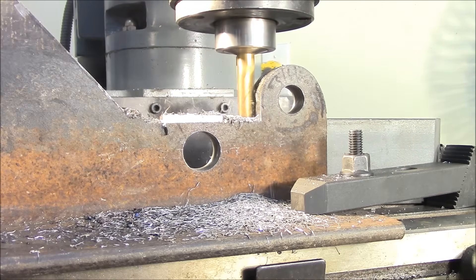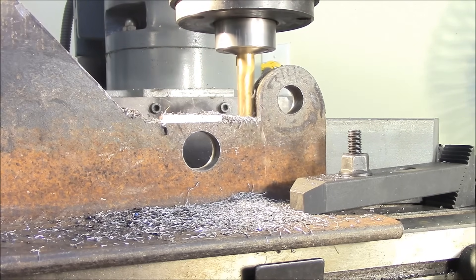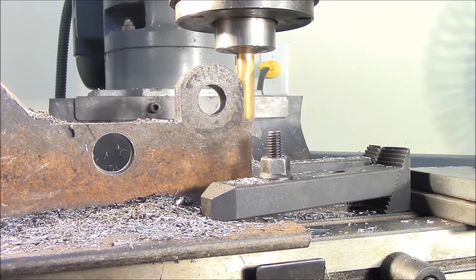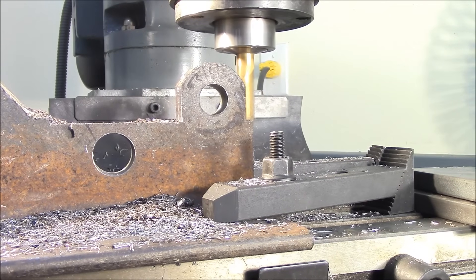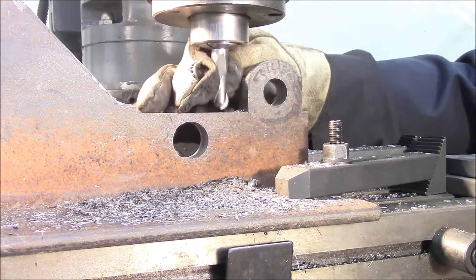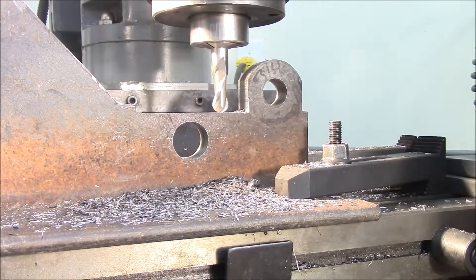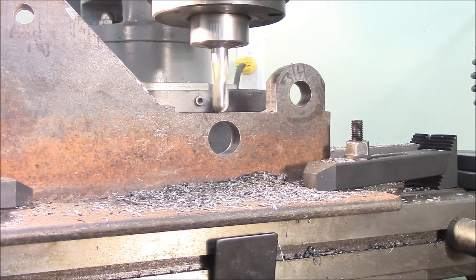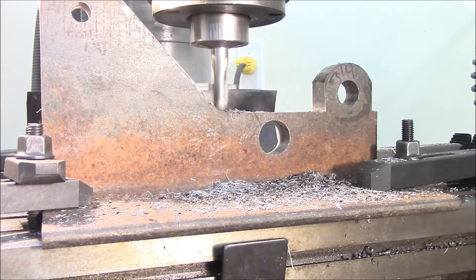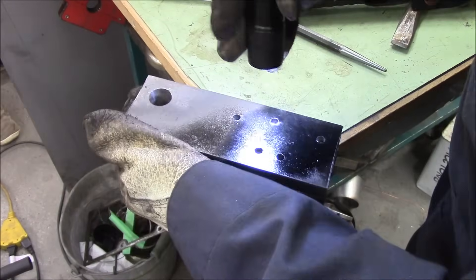This was just cleaning stuff up using the milling machine to get a nice flat surface. You want to measure correctly between the center where that hole got drilled and the top of that flat. I'm just using a ball nose to smooth out the transition from the horizontal up the angle side.